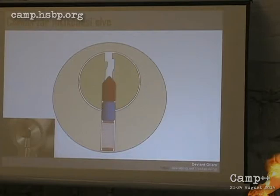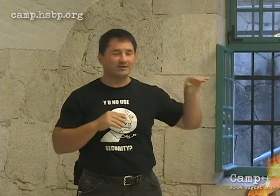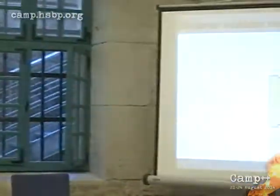The problem is, we have only two hands and only two tools. One tool is the tension wrench, one tool is the pick, and we have five pins, and we are not fast enough to push all the pins together at the same time, at the same level, because this function has the key, and we are lock pickers, and we don't use a key for opening a lock. Therefore, we should find the pins one after another, and we should push the pins one after another. How is it possible?